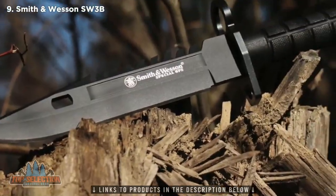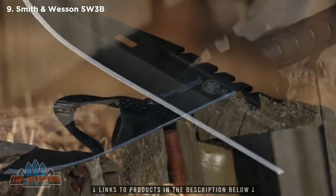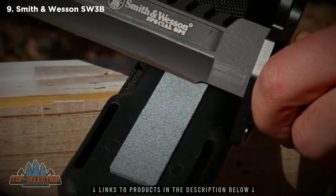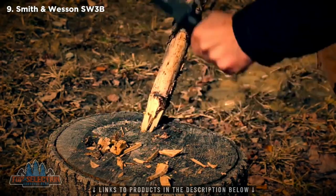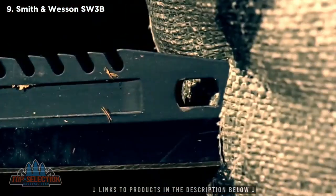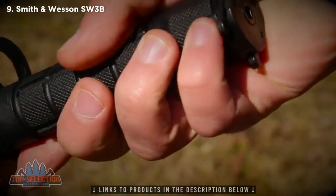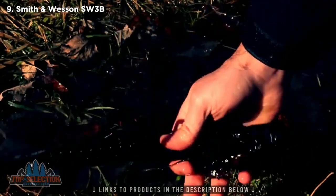The long 19.7cm blood-grooved blade is fashioned from strong, hard 420J2 stainless steel, easily sharpened in the field, and tough enough to handle the impact cutting demanded of a bayonet. The spear point of the blade's thick stock yields impressive piercing strength, and the textured, deeply grooved, black nylon fiber handle stands up to the challenge of harsh operational and survival conditions.